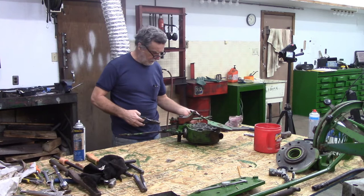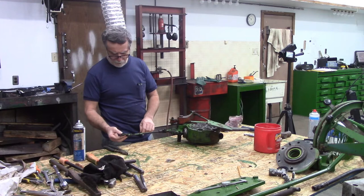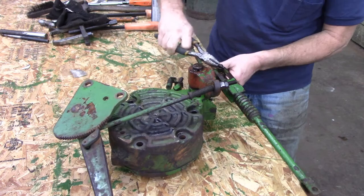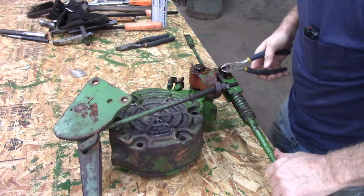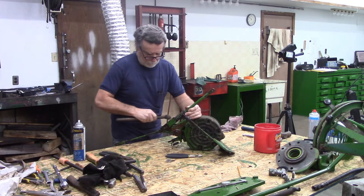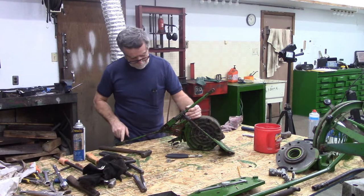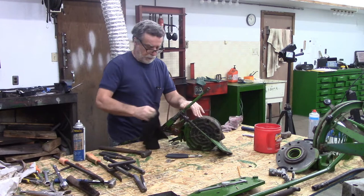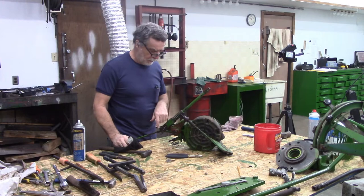Taking a few photographs again, as I always do. I've got a buggered up cotter pin there and we're going to get that off first and get this piece that I broke off — that just threads off there. I'm not too concerned about that; I'm pretty sure I can just weld it or probably just find a different hand for that. That is pretty snug in there as well. That's an easy thing to fix. If I break this cast arm, that's not going to be an easy thing to fix. So I think we're going to put penetrating oil all over this, but I'm also going to put a little bit of heat on that. I don't want to take a chance breaking this other housing.